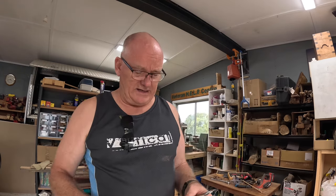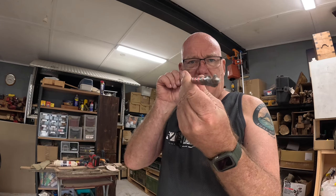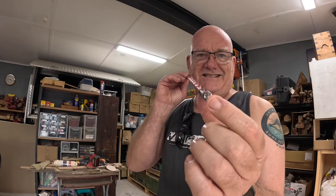So you know how I explained that in the first drive, it went in and then it dove down to the right, and then going from the other direction, it did the same thing. Went in and then dove down to the right in the same place, more or less. I couldn't see any knots or anything in there, but there must be some density in that part of the wood. But anyway, the drill bit is permanently bent towards the tip where it went in and started to dive. It went in and dove so hard that the drill bit bent.